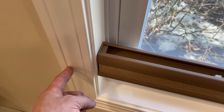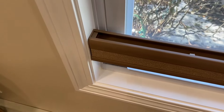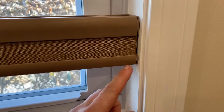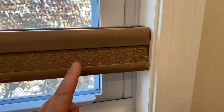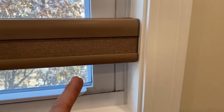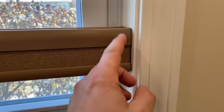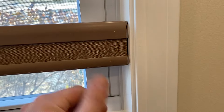If you're doing it on the outside you just have to measure and get it close, and you won't have to be as accurate. The instructions say you can take off two inches on each side without running into issues, so up to four inches total — unless they are 23-inch wide shades, in which case you can only take off an inch from each side. I'm only taking off a half inch so I'm just going to take it off of one side.